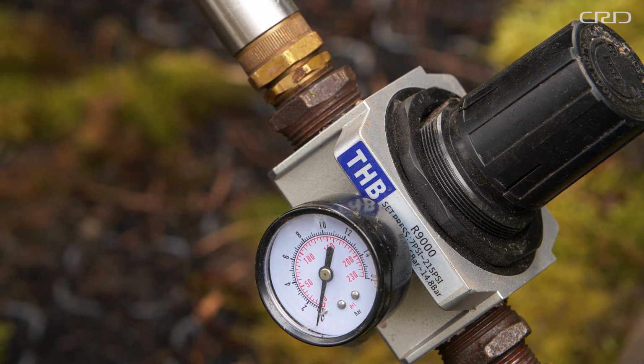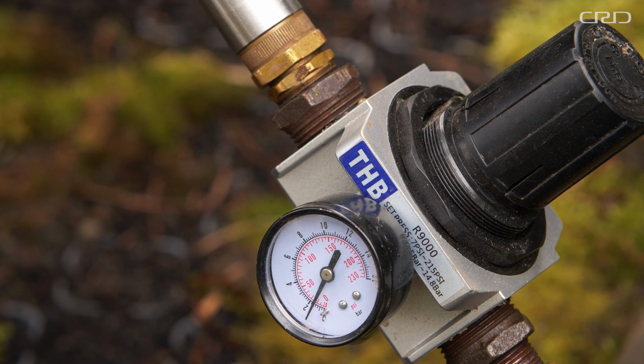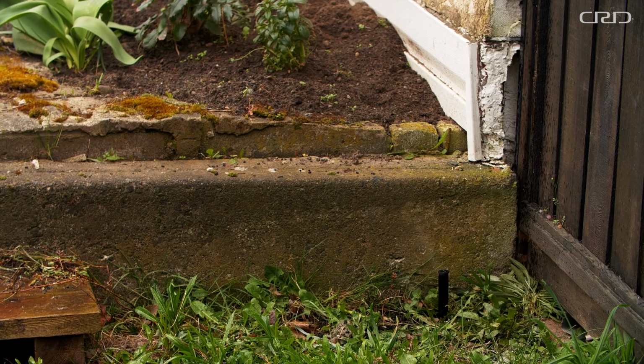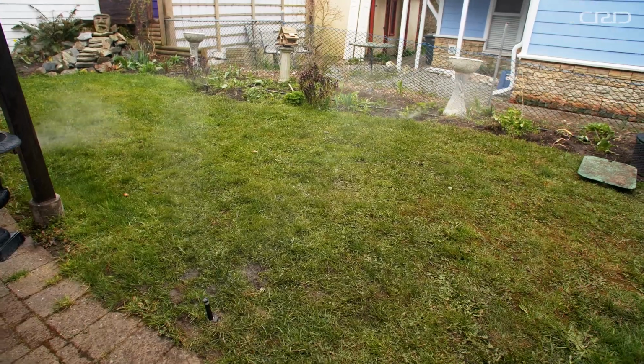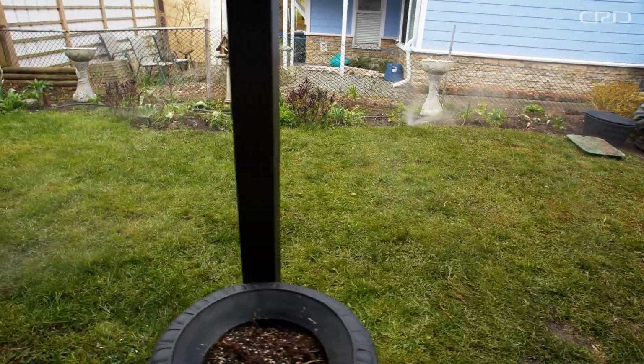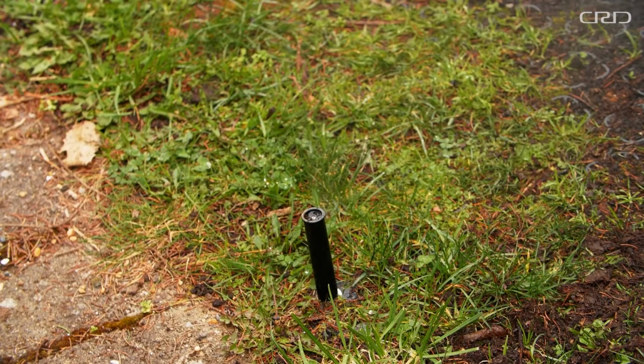Run through the entire system twice with 2 short passes, as it removes water that has drained from one zone into another on the first pass. It also reduces the amount of time compressed air is moving through the dry pipes, which can cause heat damage.